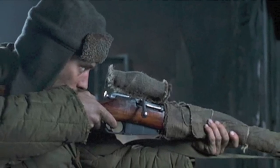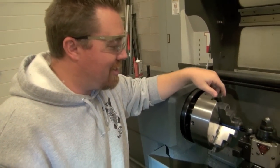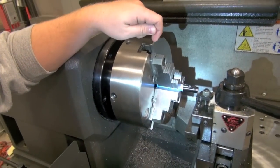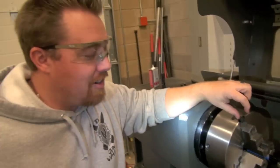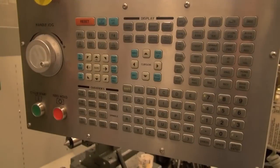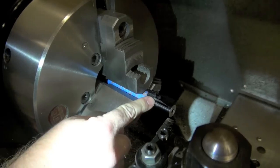Ruger. No, it's out. You know, when we turn this on, you'll see what it is. So we've already zeroed this tool. This is going to cut our main thread tenon, just the length and the diameter, so it's half inch. We're going to do Silencer Co. Sparrow spec threads. So it's 480 thousandths long, and then we're going to cut a relief for your O-ring engagement, and then we'll go in and thread it. So you're a little over 650 thou, so we'll call it a little bigger than 5/8 of an inch diameter on your barrel.